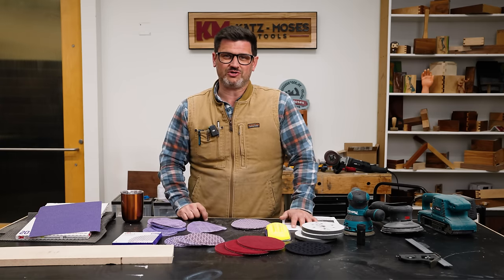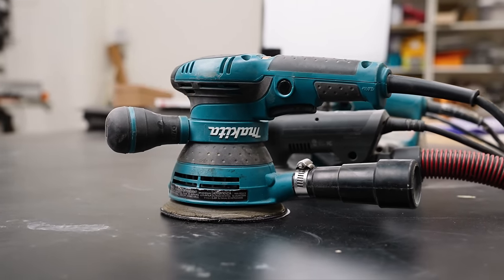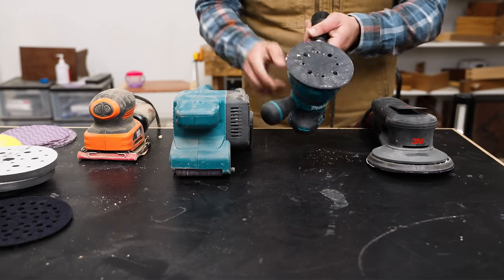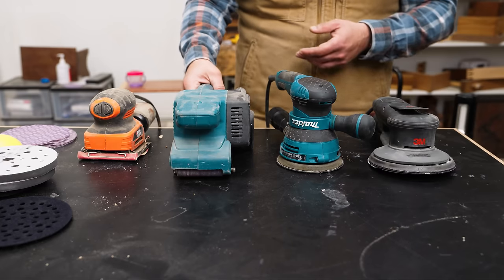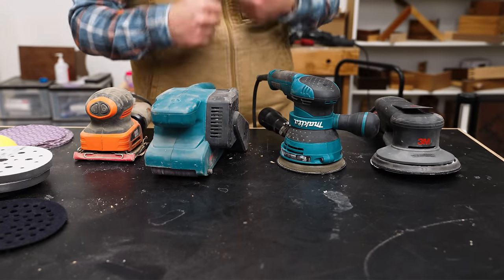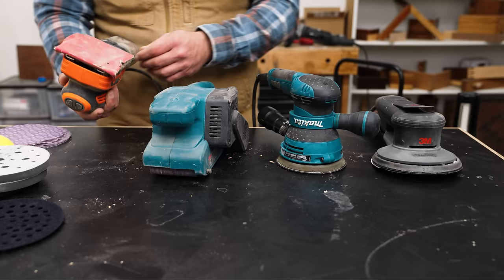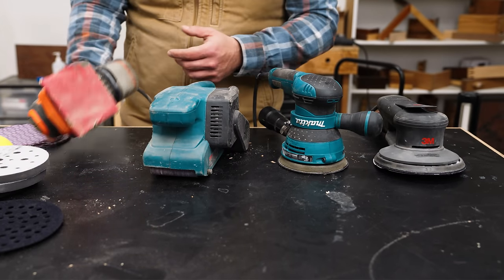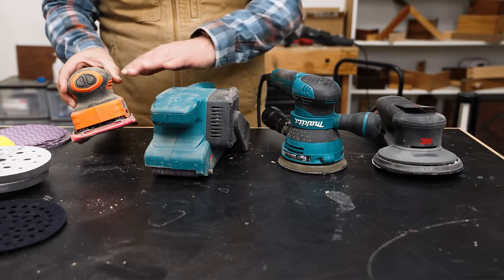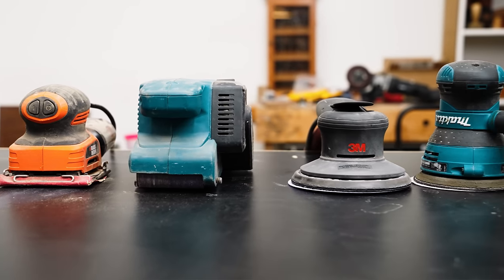Come on into the bench, let's talk about which type of sander you should pick. These are the three basic types of sanders you'll see in most shops. The random orbital sander is everybody's favorite, and the one I use 99% of the time. It spins while also oscillating, which creates a random scratch pattern so it's not visible when you're moving through the grits and putting finish on. A belt sander is for incredibly fast stock removal — I'll only use it to remove finish or paint, or to take down stock in an already assembled project. A pad sander uses square sheets of paper in quarter or half sheets and just vibrates, no spinning. These are much less aggressive, great for corners, but if you're just going to buy one sander, get a random orbital.